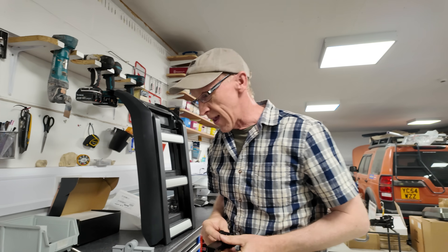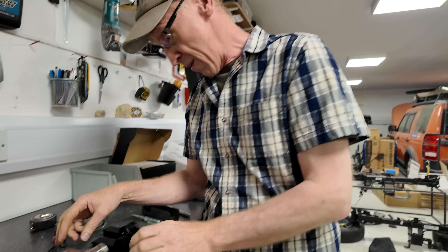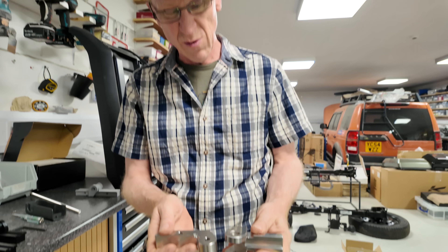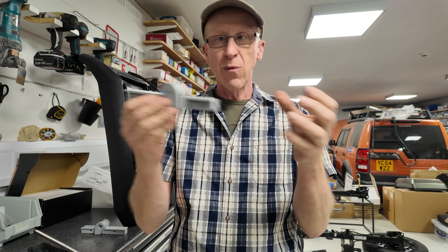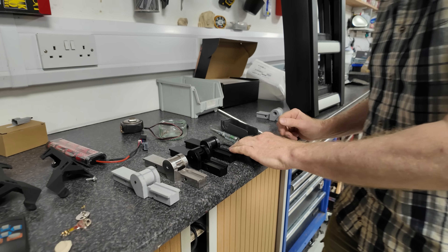So we are going to do a test today. People asked if I could redesign it, so we have redesigned it — we've done the CAD files. This one is in aluminium; we used 7075, which sounds expensive. Then we also did one in stainless steel. These are not cast — they are all made from billet, where you take a big slab of metal and machine it; you can see all the CNC machining. We also 3D printed one just to check dimensional correctness before spending money on CNC machining. These hinges fit in the ladder with two bolts that go in the side and slide into the extrusion.